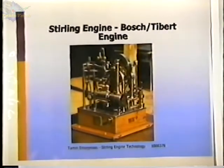This was a little model that was built by a machinist. I don't know the machinist, but I know the present owner of this engine. It's not a very large engine. There's a propane tank under here that fuels it, but it's kind of a Rube Goldberg, and it's a gamma type engine. Here's where the burner is in the stack, and he's got a flywheel over here. There's a radiator on the opposite side, and he's got a water pump that pumps water through the radiator. And this thing up here that looks like a governor is really a tachometer. The faster it goes, the balls come out, and it raises a pointer on a scale under here that gives the speed. It's a beautiful piece of work. It's all brass and stainless steel, and it's something to see run.